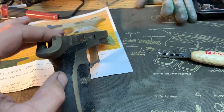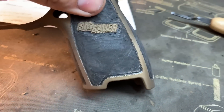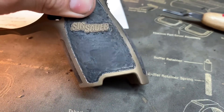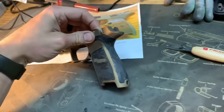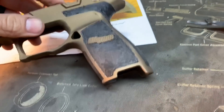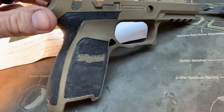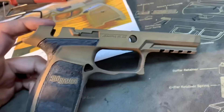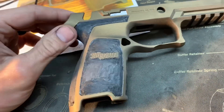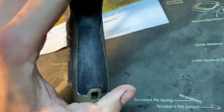You can see that looks a bit rough and fuzzy — the stippling and the flame bath will take care of all that and it'll look much cleaner after stippling. The back strap is done the same way: cut the border down then follow those panel lines. Same thing on the front — I use the tool to cut out the border and then sand within that. It's super tedious work staying inside those lines. Cut those borders out good, stay within those lines, because anywhere you're going to stipple, cerakote needs to be sanded away. I call these cerakote-stippling jobs 'combos' — you have to sand away any cerakote before you get going.